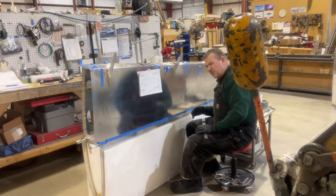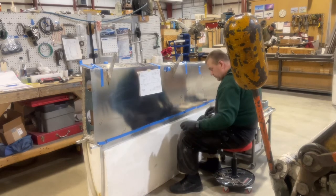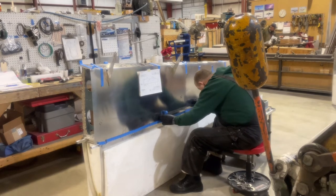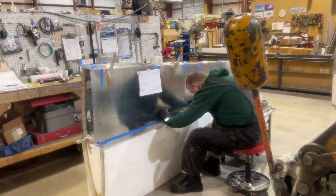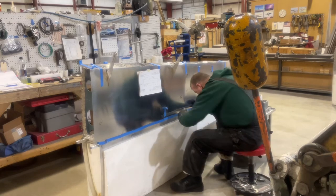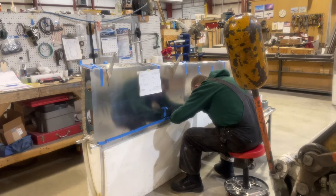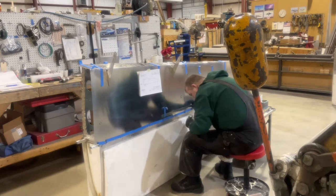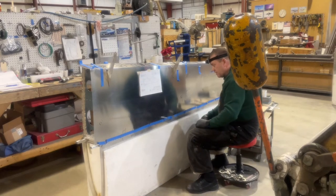On the left wing, I was pulling the skin off and doing this on a layout, and I found that it was just as quick to make a ruler that was fairly flexible that I could just tape up. So that's what I do. Now we'll go through and center punch these, and then I'll come through and drill.